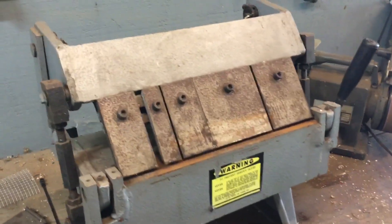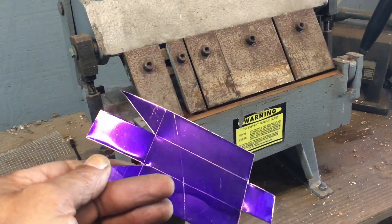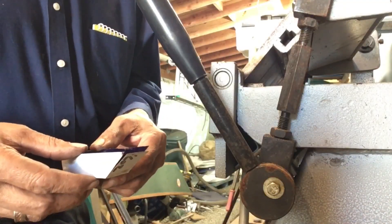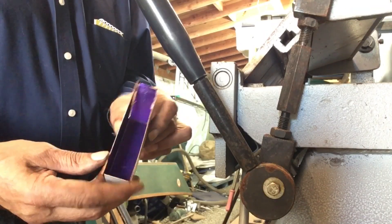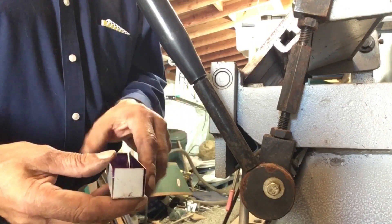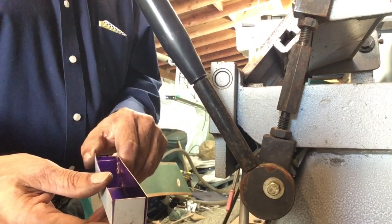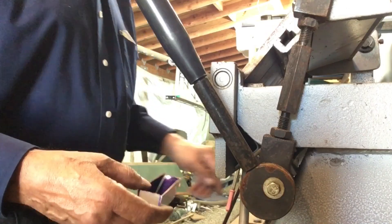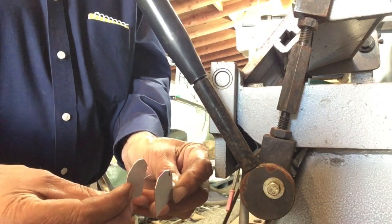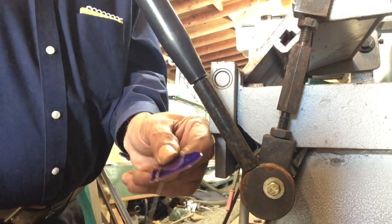The copper parts have been cut into the box form. I bent the box into shape, and then I'll get the edges finished off so that I can solder them shut. Then we'll cut the tabs here, which will be the ends of the tank. I'll need to cut in for the saddle — I'll do that at the workbench.